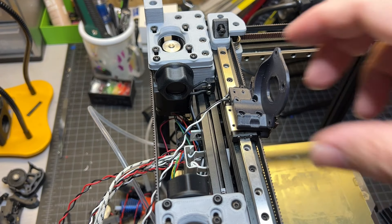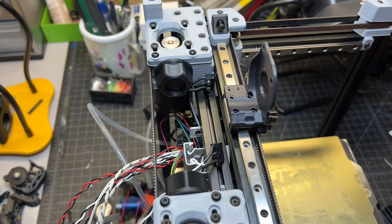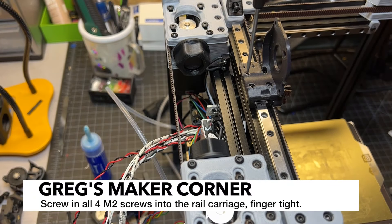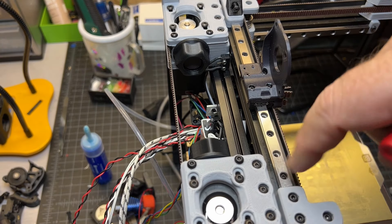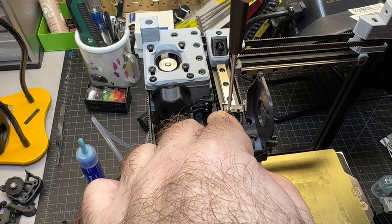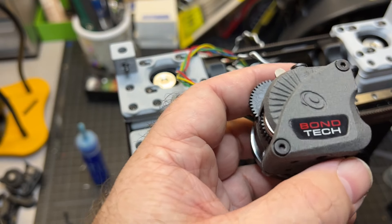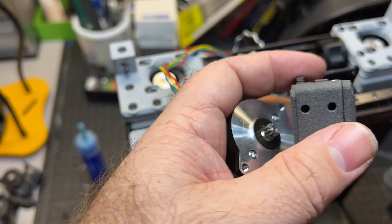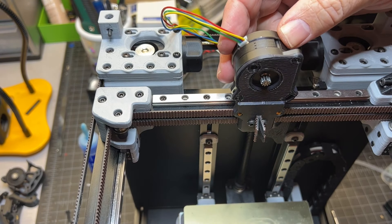Now I'm going to go ahead and attach the carriage to the rail using the screws from the original mini afterburner. I also recommend lock-tighting these because they're kind of hard to get to and you have to disassemble things. We're also going to need this little end stop. For threadlocker, I like to use blue Permatex — you can find it in the video description. Don't over-tighten these. Double-check your gaps — you can see right here I don't have any, and that's what you want. Pay attention to orientation on this one. Then I'm going to do a dry fit just to make sure everything's going to sit there okay.